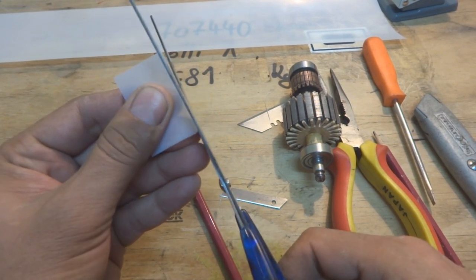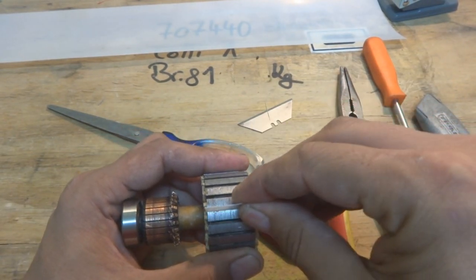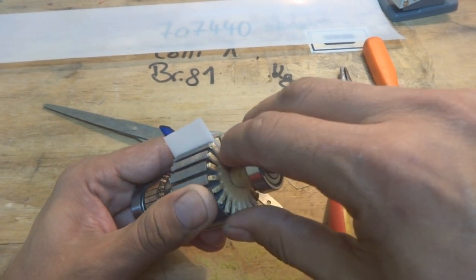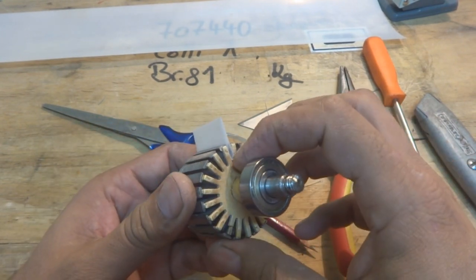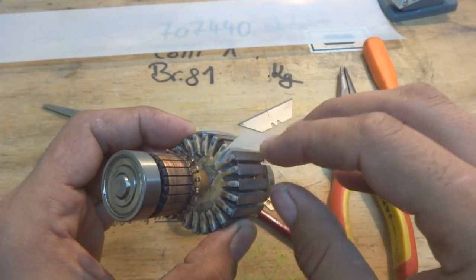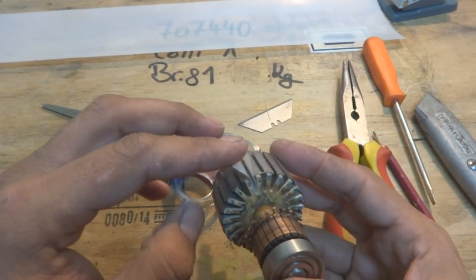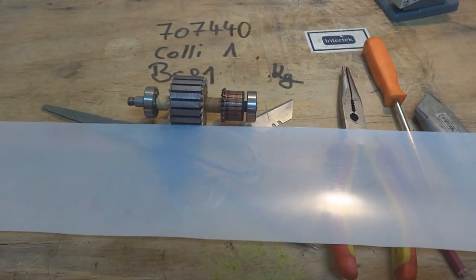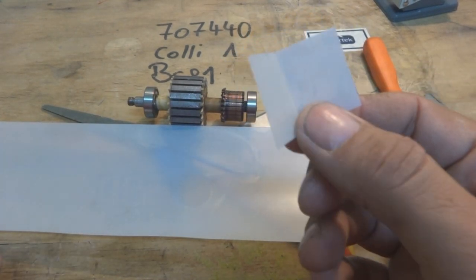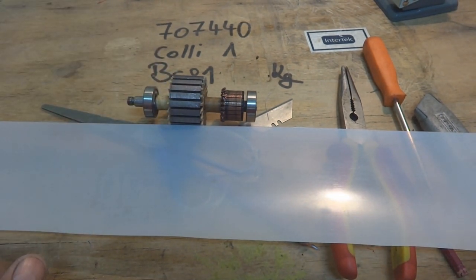I cut a little more while preparing this template. All the other papers I will cut according to this template, so that much effort will not be required each time. We are putting it again in one of the slots to see how it fits — barely touching on both sides. This is our template. According to this we will cut a further 22 papers, because there are 22 slots total. This is a simple procedure, same size each time, and then I will show you the result on the armature.